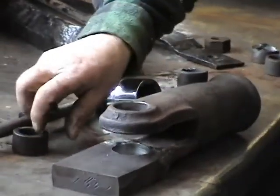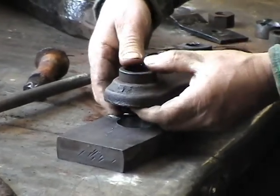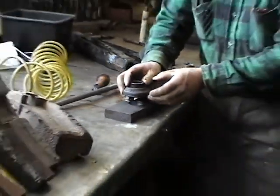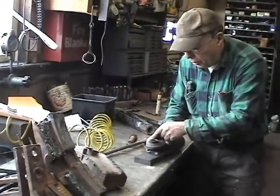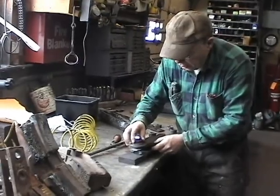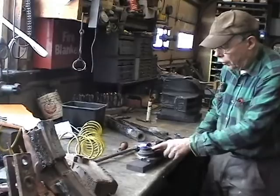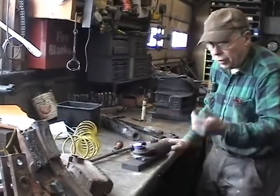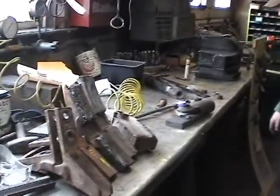They're supposed to press in, by the way, otherwise they'll fall out. And if they don't, it's not something they did originally, but what we do is occasionally just touch a little bit of weld there to hold them in place. This one may or may not press in properly. They're made just a little bit oversized, and then with a hydraulic press they push them in. All right, I think that's all here.